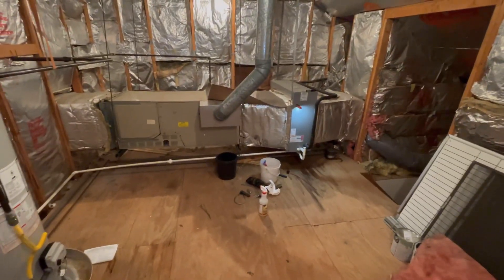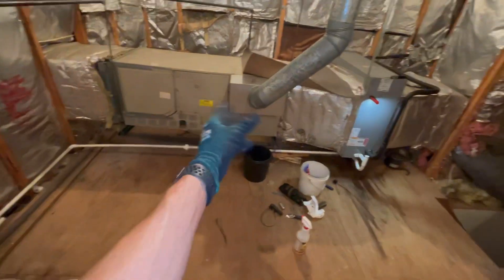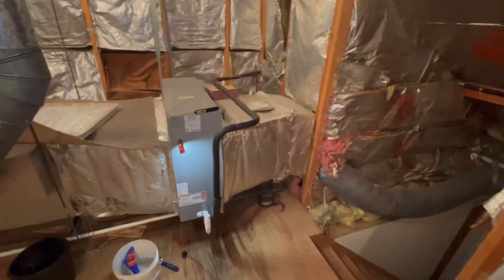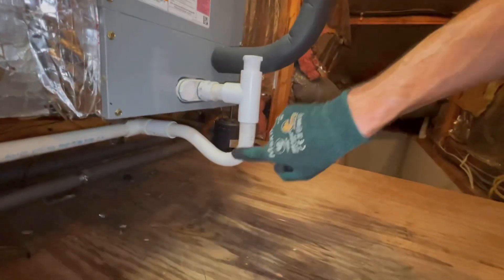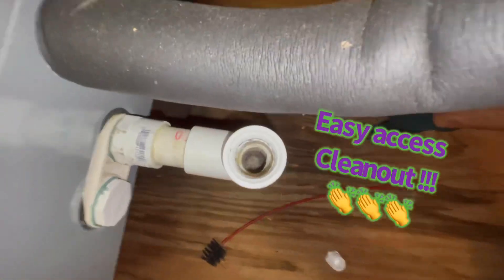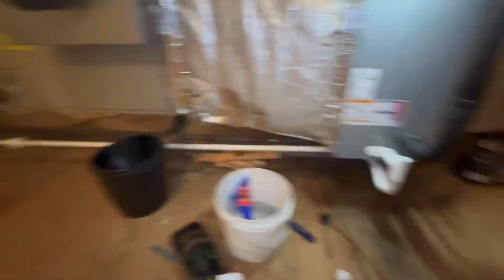This is one of the other tenants at my dentist's facilities. You have the return air — it goes through the old furnace, it can be heated or cooled. This is the evaporator coil I had installed here with one of my buddies in 2017, and it's been working well. Tubing looks pretty good. Now look at this trap — there are no separate elbows or anything, it's free-flowing. You can take the cap off and flush it down. The trap actually looks pretty goobered up inside — goes out and over towards that hot water tank.